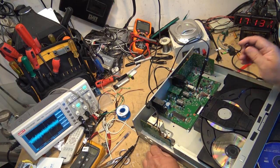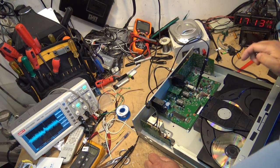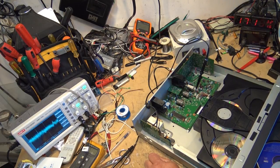Okay, that's performing a little better there. I'm still seeing some peaks here. I don't want to have that play for too long there, because you know how it is, right? Okay, let's see if I can get... I'm going to try the EF balance. The control I was adjusting there was the tracking gain, by the way, T gain. This is the EF balance.